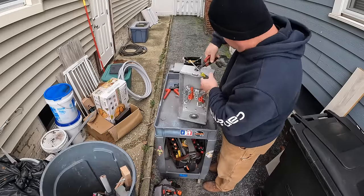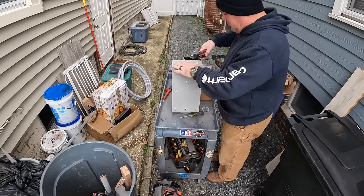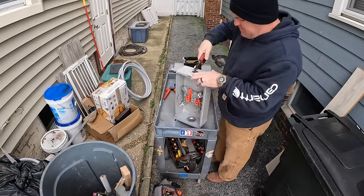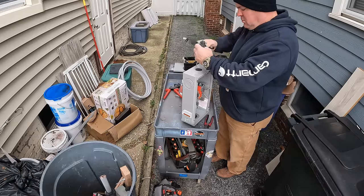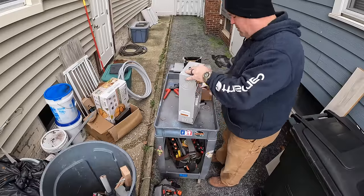I've been through this before with the utility company. You need to use each one of those openings to attach it to the sheathing on the house. Why you need to do all six, I don't know, but that's what it's spec'd for, and that's what we do. We'll also take out the concentric knockout on the bottom for the load side conductors.